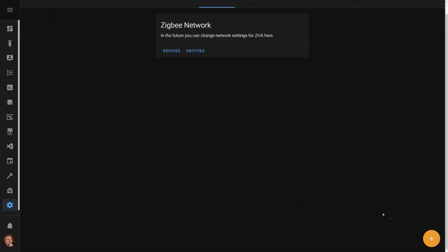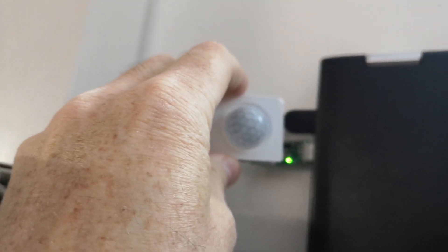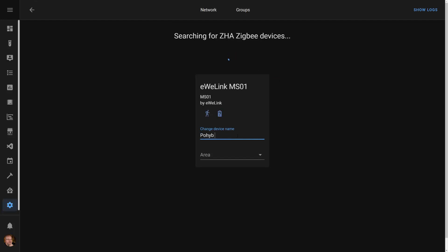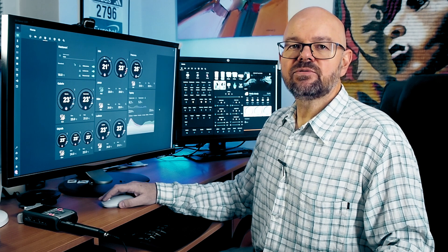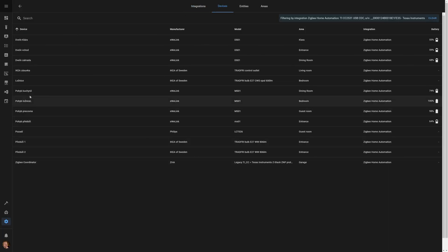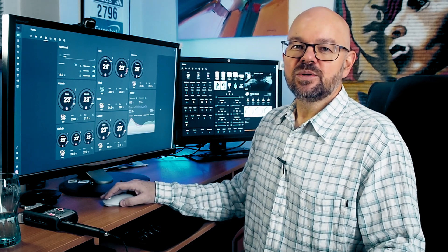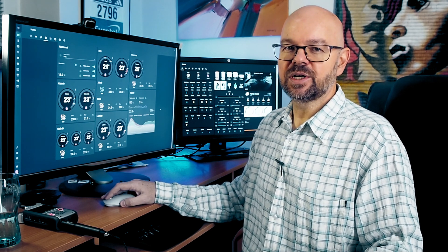Go to ZigBee, configure, hit the plus icon at the bottom. Then switch the device to inclusion mode, bring it a few centimeters from the controller, and leave it there for about ten seconds or more — it should discover and add the device. Click on the device and finish the configuration by changing the name and picking the room. Devices don't have to be added through the controller but through another AC-powered device — just select 'add device via this device' instead of the ZigBee configuration. The ZigBee network is a mesh where devices connect to one another and always find the best path to the controller. This is also great if one device goes offline — it will find another route through the network. Only AC-powered devices act as mesh routers.